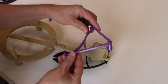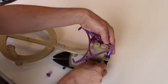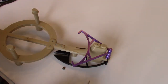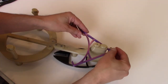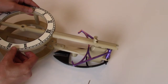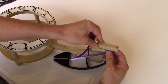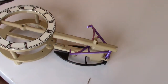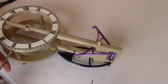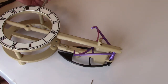The pallet is going to go on like this. There are two spacers — the large spacer goes on first, then the pallet slides on, and then the longer narrower spacer goes on next. Place the second small bearing on, then the front frame should be able to drop into position. Line up the bearing, take a couple of screws, and lock them into position to hold the frame in place.